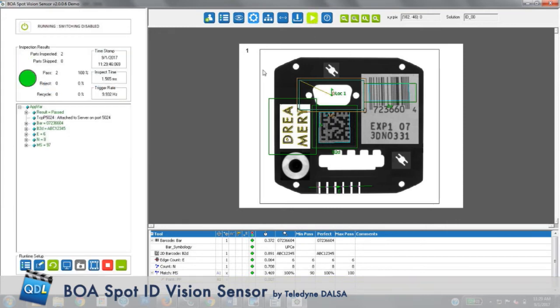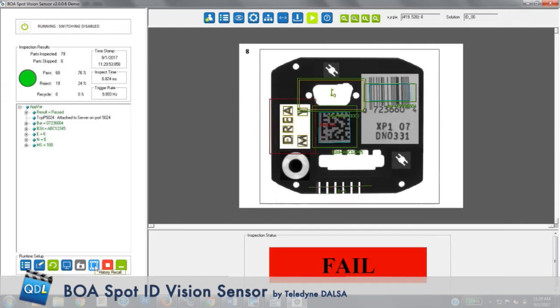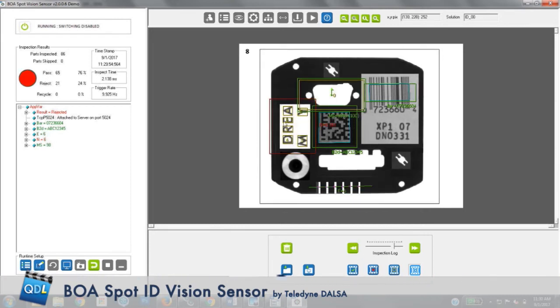I can now run the program — we are now pretending we are measuring parts. We see some passing, some failing. If I stop it and step back through, this is a known good part with nothing failed. This part is fine. This part gives me a failure — looking at the bottom I can see there's a slot missing, indicated by a red line and red dot. It detected that this was a bad part. Stepping further, I find a part where there are only six letters instead of eight in the label — it detects it, marks it, and flags it.